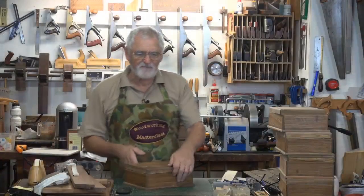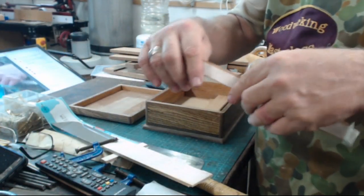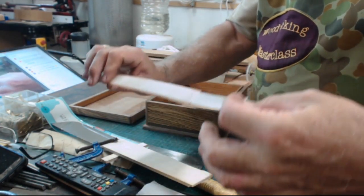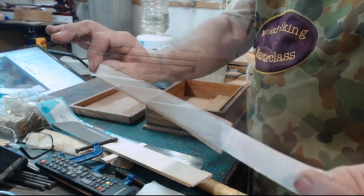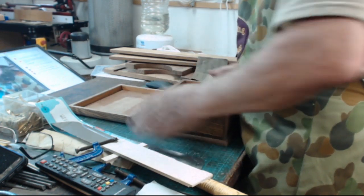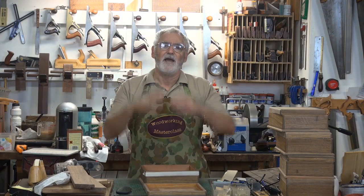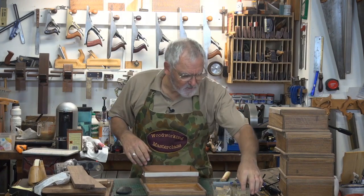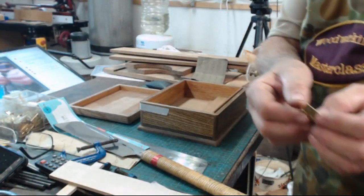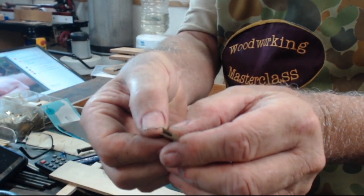The reason for that is they've preloaded the hinges. So what I do is get two pieces of veneer and masking tape, then wrap the masking tape once or maybe twice around the veneer, and tape that to the back of the box. What that does is give me an air gap which allows the hinge to close, because if not, when you pull a hinge down it only closes about that much — and that's what keeps the lid open.